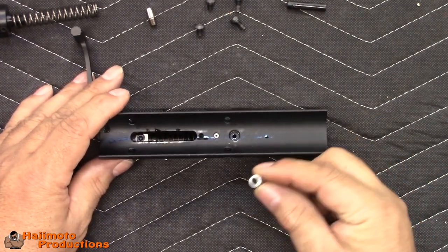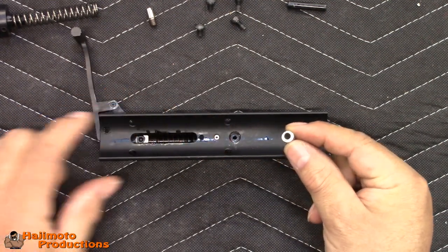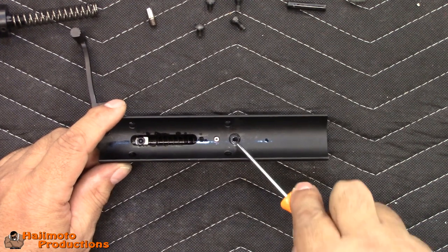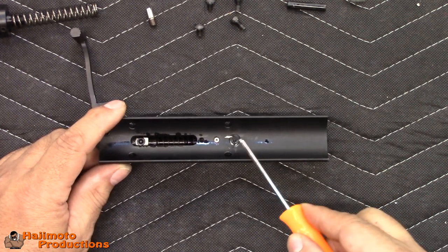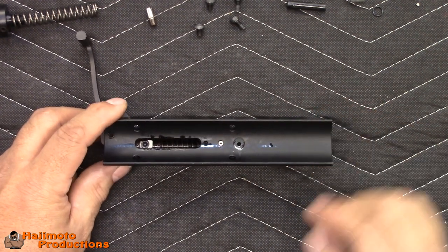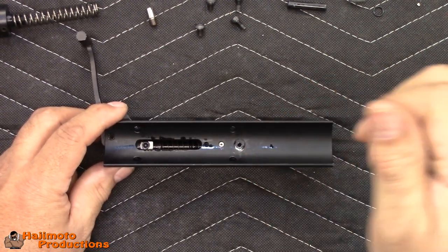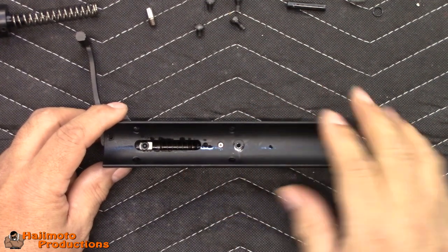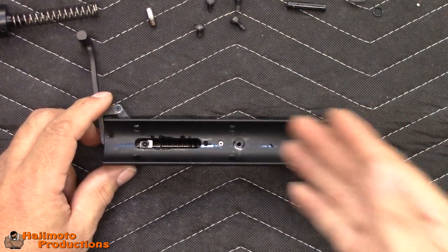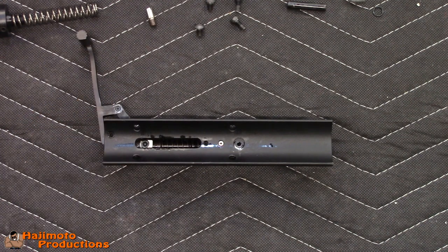As long as we don't increase it so wide that the shoulder gets removed for the O-ring down in there. So let's go ahead and remove that O-ring — it's at the bottom, like that. What you could do is take this to a drill press with a 3/16ths drill, drill it down through, clean it up so it's not rough, get some of the burrs off the edges. Or we can simply do this with a hand drill, which is what I'm going to do here. This is aluminum, it's very easy to do. So that's what we're going to do with this modification.